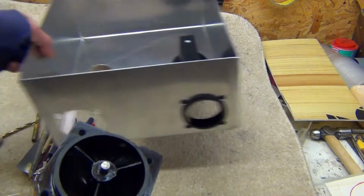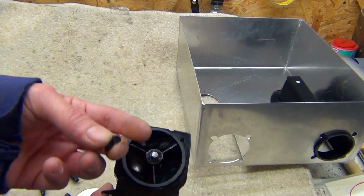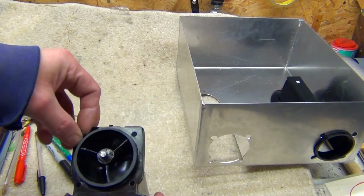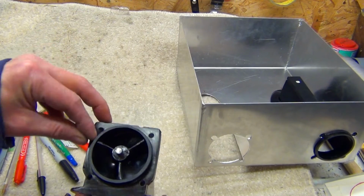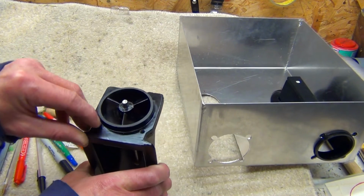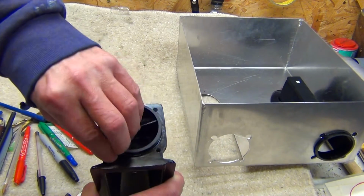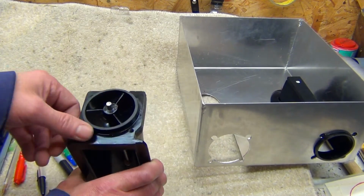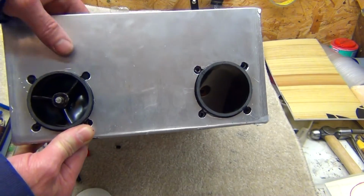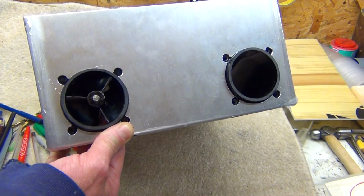And as you see, what came with the bag was some little black grommets. Yeah, these little things. They just go in. Yeah, put them in the others as well. You get the idea. Anyway, you get the idea. And the reason for that is, once you're gluing them in, all the squidgy glue that starts coming out will not then go in the holes with the threads, and you can pick them out at a later date.